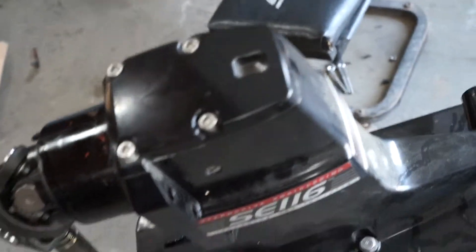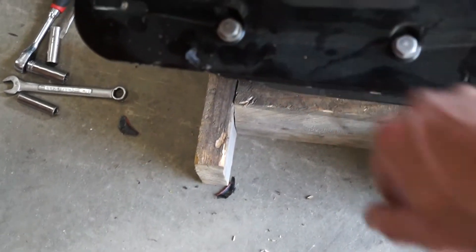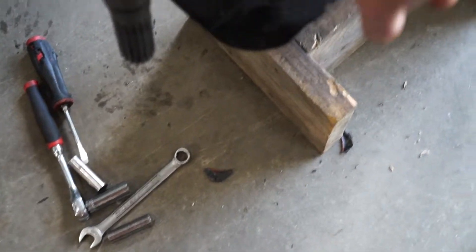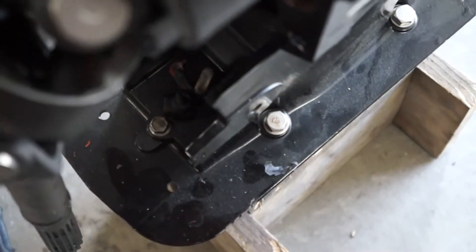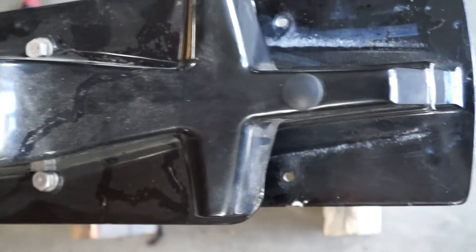I can show you the bolts we're going to pull apart. We're going to pull those two through bolts and a single bolt in the back. Make sure your speedometer fitting is off. The trim tab is going to come off, and then there's going to be one bolt underneath after the trim tab — I call it a trim tab, this one should have the flat zinc — but after the zinc comes off in the front.